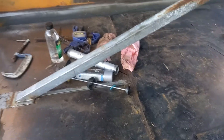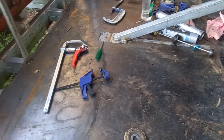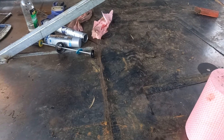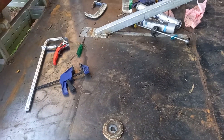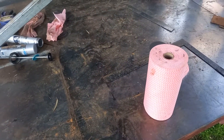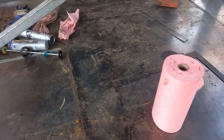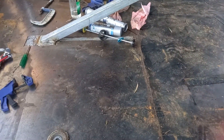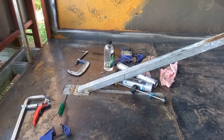Broke my sausage gun, which is a pain in the butt. These plates here aren't actually welded in position — I've used Sikaflex 11FC and it's actually glued in position. The beauty of that is it makes it watertight but also structurally sound.